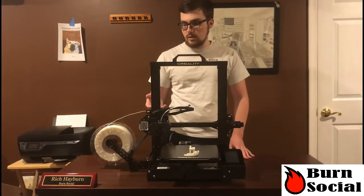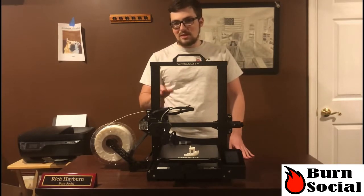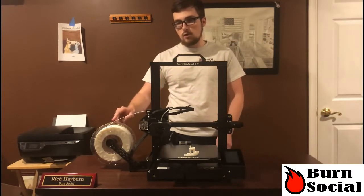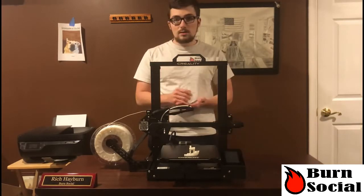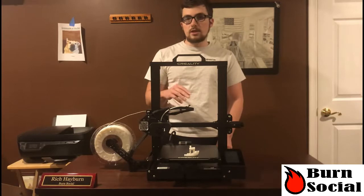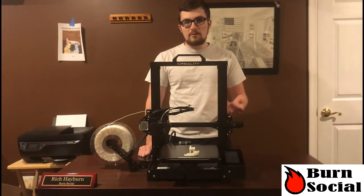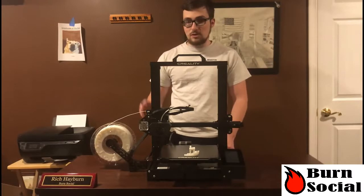Now that we got the part out, I want to give a general overview of my thoughts on the printer — things I observed while using it and putting it together. To start, getting the filament in through the extruder was a little bit difficult. I haven't opened up the mechanism yet and don't really plan to. I think it's just a little bit of trial and error with what direction you clip it in. I'll always bend my filament up slightly since it comes off the roll a little coiled, so it can go in and have a straight path through rather than curving down and hitting something. Also, on the second print of every test cycle, the Z-stop wouldn't work correctly and would actually be up too high during leveling, but just resetting the printer would fix that every time. That's really all I have for negative aspects.